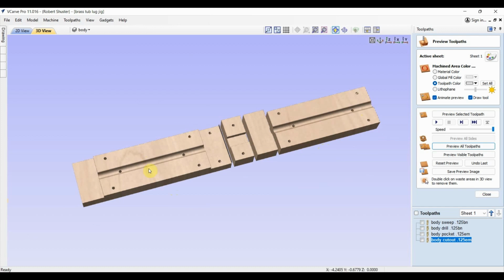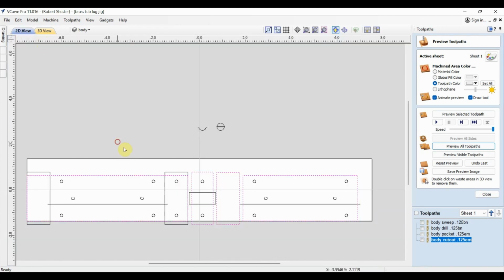And this piece flips over upside down on top of that, so it conforms the jig. Four holes here match up to the four holes here. I will put a screw through there and hold it tight. It'll hold the jig in place so it won't move around when I'm cutting with a hacksaw or drilling the holes or tapping the holes. So let's go back to where I designed this.